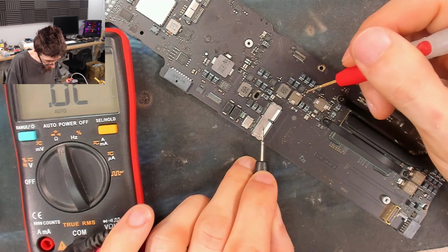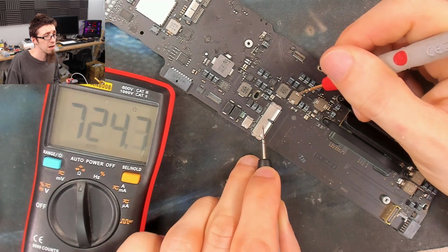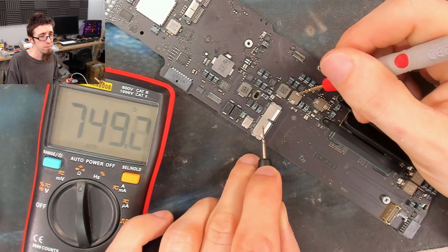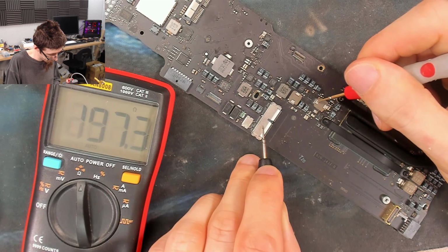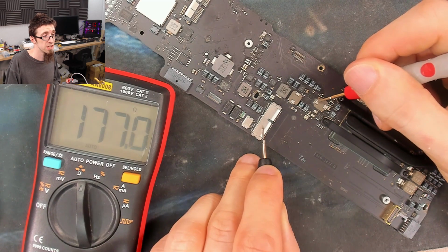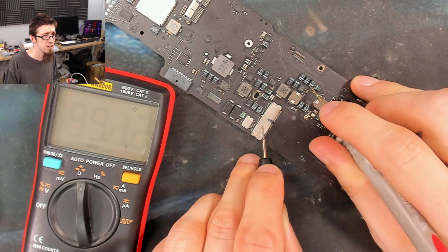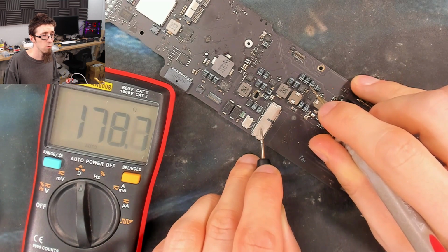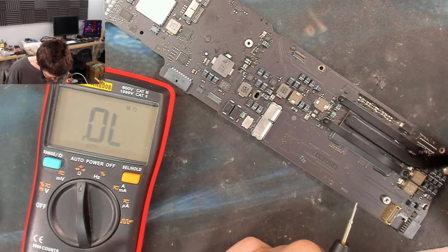So here's our DDR regulator. See, that one's going up to 750-ish, so not the same. That's probably fine. So what about this one, our 1 volt rail? See, that looks exactly the same. 176, 177. And if we go up to HS Computing iSense, which is on these resistors here, these capacitors, that's going to settle on, okay, 178. So yeah, it's this guy, it's this area. So has that MOSFET failed, I wonder?